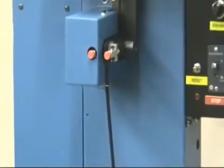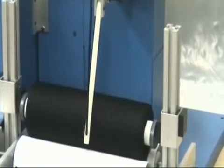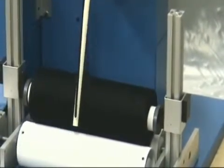Takedown rollers and the roll-up spool's driving drums are precisely controlled with a DC-driven gear motor. The weight of the spool keeps it in firm contact with the roll-up driving drums.